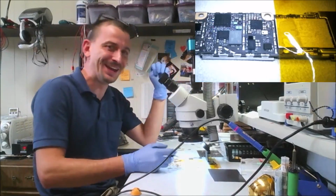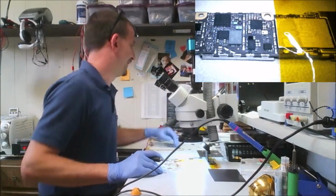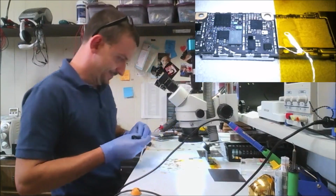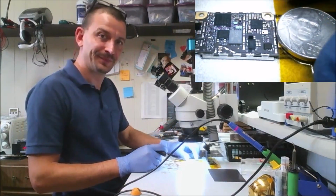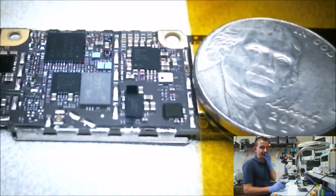Okay. Where was I? Oh yeah, I was going to heat the rubber coating on the Tristar IC on this iPhone 6 board. I'm going to throw a nickel on the NAND. It is underfilled, and I hate underfill. So, alright, let's see if this camera will cooperate. Let me get my focus bar selected, since none of this equipment is made to work the way that I'm using it. It's about as good as we're going to get there.